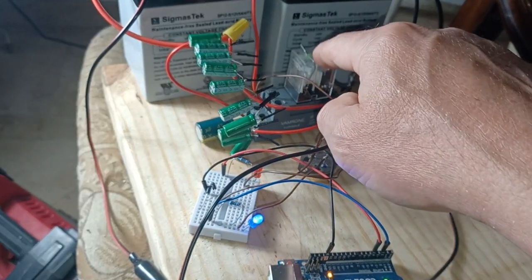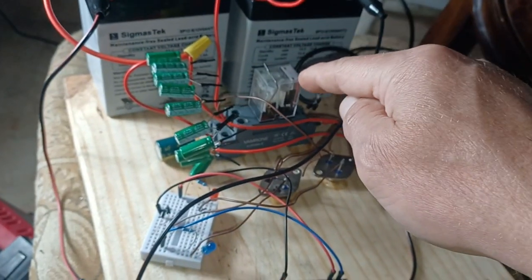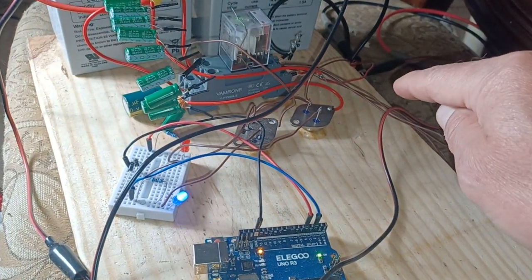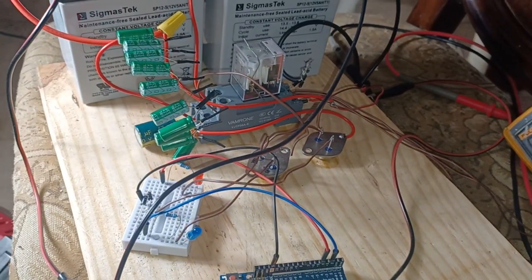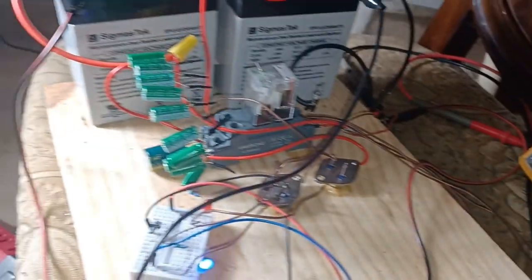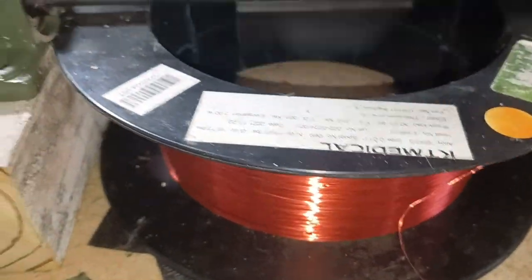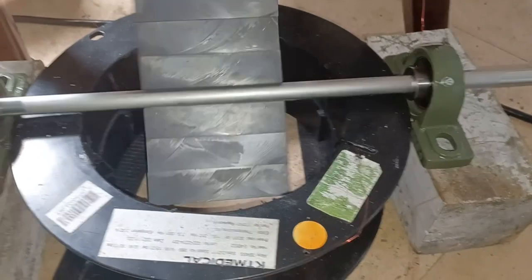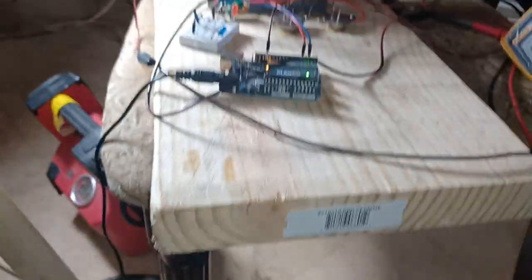The negative is being switched to trigger this with the bottom transistor and the blue LED. The positive from the 12 volt is jumped. The other transistor is the red LED, which controls the negative to feed this capacitor bank and fill it up with the battery voltage. The capacitor bank runs the coil — it's a 350 ohm, 5,000 foot, five and a half pounds of 28 gauge. This is a Newman-type setup: high impedance coil, large magnetic mass.